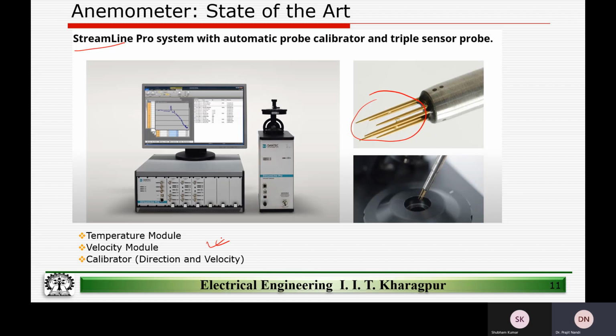So this is very important in general for all realistic systems that we'll end up designing. But calibration techniques are not a part of the course, though this in itself is a pretty interesting thing to understand. And then of course there are probes. There is an A to D, an analog to digital converter, which will convert the analog signal to a digital output. And then of course there will be software for data processing. So all those linearization, you saw the curve, right? It was like this, right? So probably you will have some software correction for all the errors that you will make because of the inherent non-linearity that will come into your measurement, right? So you'll have some software to correct for that.